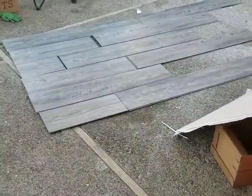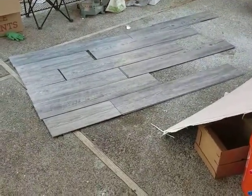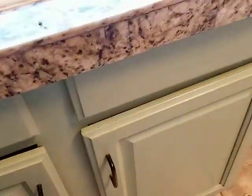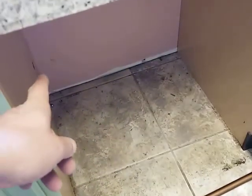As I removed each piece, I found that water had leaked out of the washer through this corner because this area got full of water. Our drain was not flowing correctly — the sink got clogged through the main line, which caused water to develop inside here and in the drain. Eventually it had nowhere to go, so it went out where the washer was.